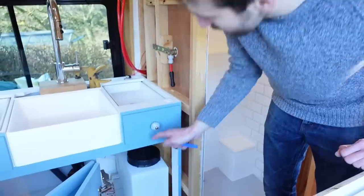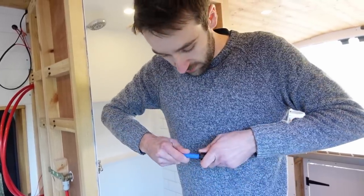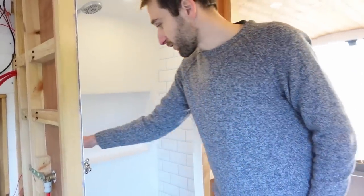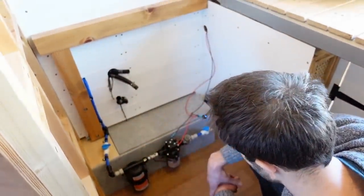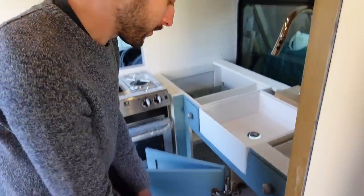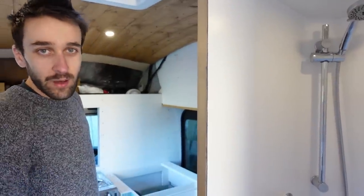On the first test we realized the pipe going through the divider of the sink wasn't pushed in all the way. We did a little test piece to see how far the pipe actually has to go in — it's actually quite far — and because it's so awkward under there it's hard to do. We pushed it in properly and also tightened up the shower valve connection. On the second test there are no leaks anywhere: the pump is pumping, water comes through, and the pump stops once the system is pressurized. The pump has a pressure switch inside — any time pressure drops it turns on and pumps more water, and as soon as you open a tap the pressure drops and it kicks back on.